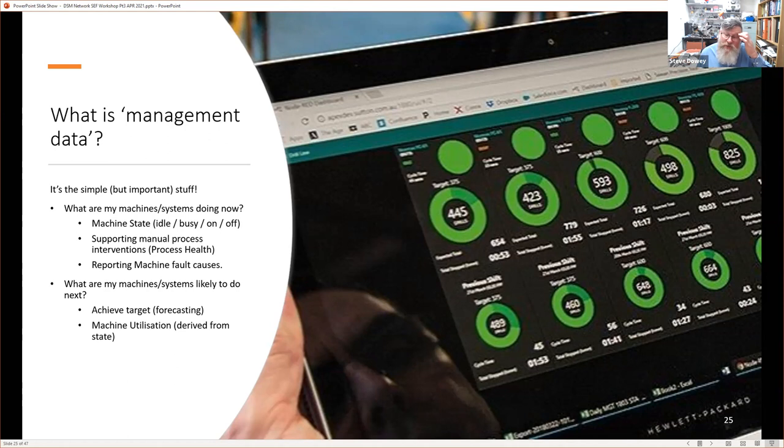There's a concept of overall equipment effectiveness, and availability is just one aspect of that. And that's essentially utilization. Is the machine available to work? Productivity is the next level. How many parts or things has it made, or how much of that uptime was useful? And then the last one is the quality aspect of it. Are those parts that we've made actually to specification?